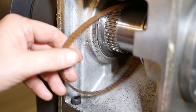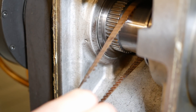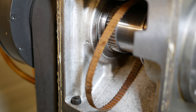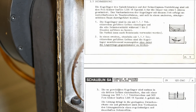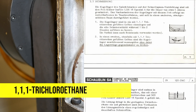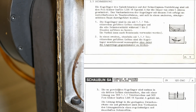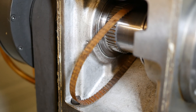Well, I guess I'm doing pretty well. This is the first significant setback I've had in this project so far. Not terribly happy about having to pull the spindle, but I guess it does give me the opportunity to re-lubricate the spindle bearings. In the manual there's a procedure for how to re-lubricate those bearings every five years. It says to dissolve some Kluber grease in trichloroethylene or one of those nasty ozone depletants, soak the bearings in it, and when you take the bearing out the ozone depletant evaporates leaving the bearing nicely lubricated. Well, that's not really an option anymore, is it?